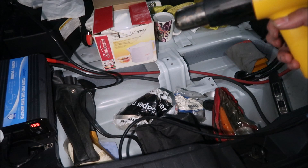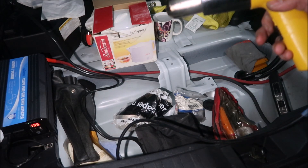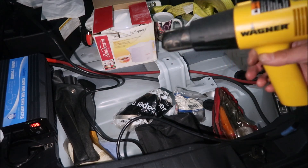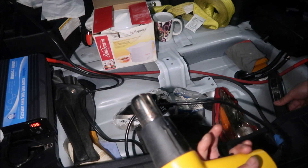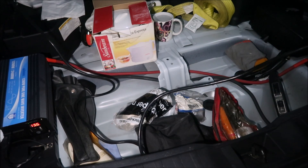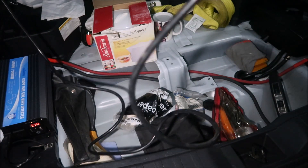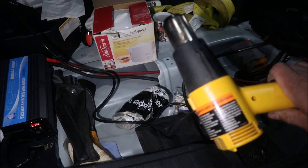Now we're gonna go to high. That's 980 watts — actually 1.14 kilowatts. It's pretty much maxed out, so just this is enough to max it out. 92 amps coming through. This is a good test — this is nearly the full power of the inverter. I'll let it run for about a minute; I'm just gonna watch the camera timer. We'll start at the two-minute mark.